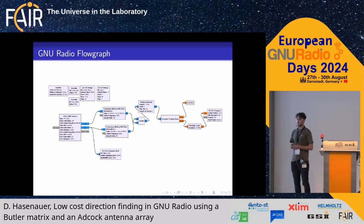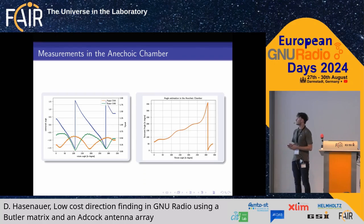Afterwards we use a frequency-selective filter to decimate the signal further and to get rid of the DC offset. Then we compare the phase channel with the reference channel using a division block, followed by a moving average to get a more stable result. Since we are only interested in the phase, we use a complex-to-phase block and the magnitude is neglected. Finally, we do a radians-to-degrees conversion and feed it to a compass. All these blocks are available in GNU Radio.